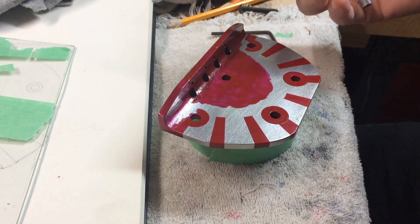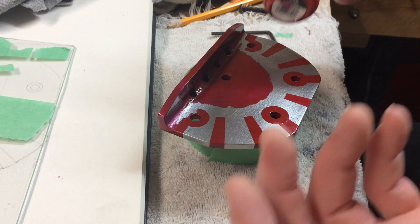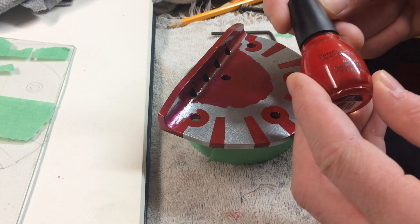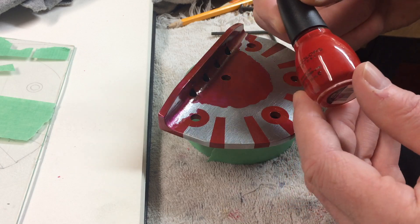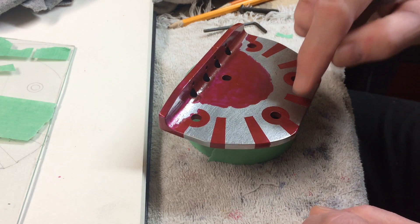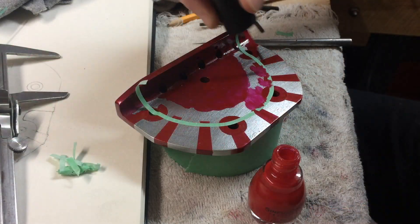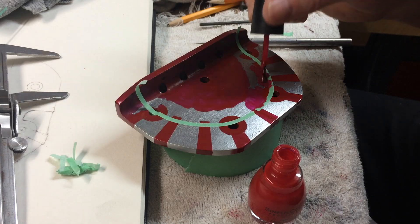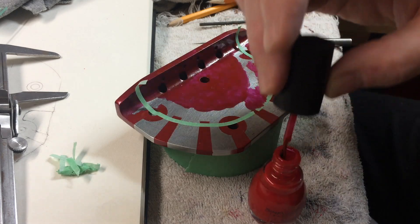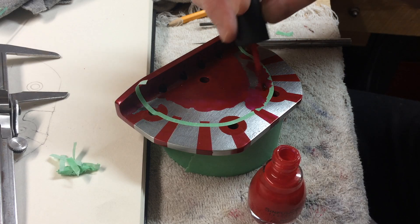The first thing I have to explain is what this is — it's nail polish. Just regular nail polish; this is the cheapest stuff they had in the store. What the nail polish is for is to protect the metal so it doesn't get etched — anything that's bare will get etched. I've used a lot of paint and different solvents through my guitar building experience, and nail polish is one of the harshest things I've dealt with. The fumes are unbelievable.